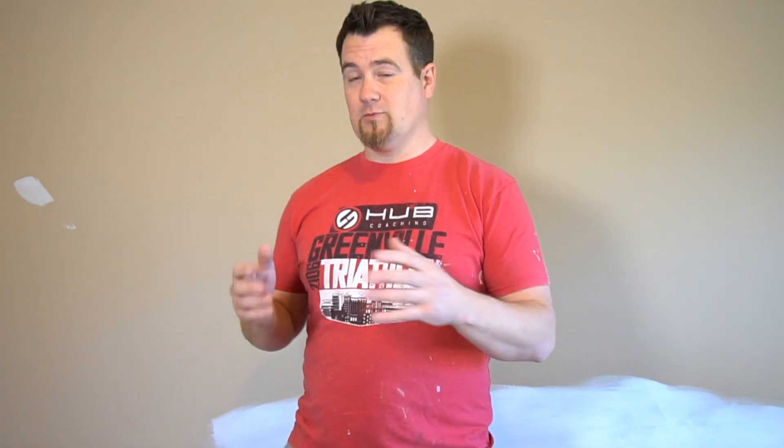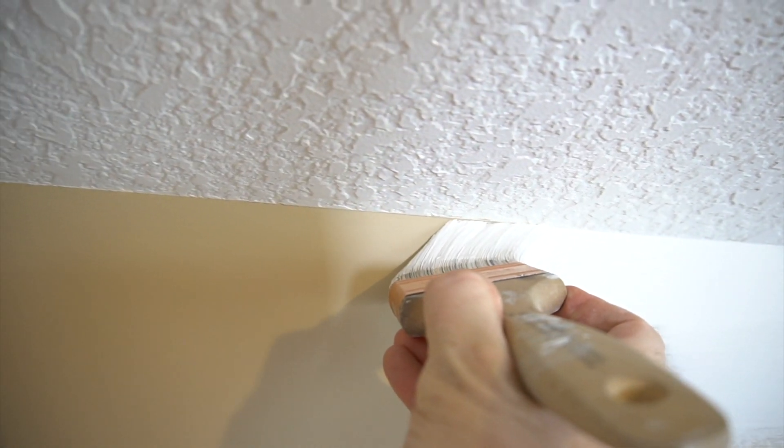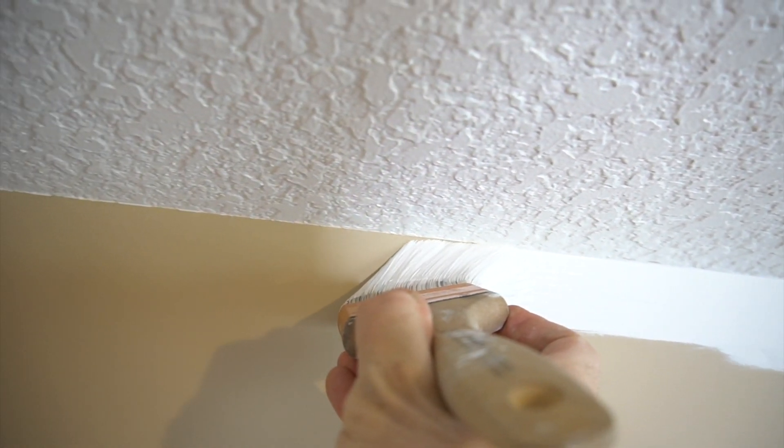As far as coverability, that's going to come down to the color that's going on top of the other color as well. So that's a whole different subject, but buy a good quality paint so that when you do your cut-in on the edges, on the baseboard, on the ceiling, around door casings and everything, the paint actually covers and doesn't leave streaks when you're cutting it on with your brush.